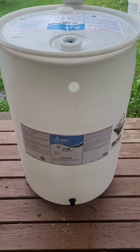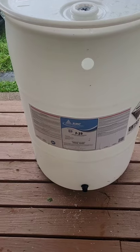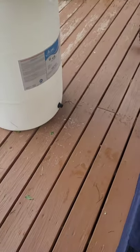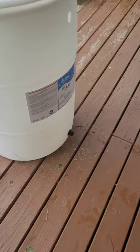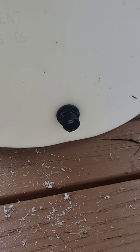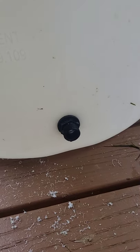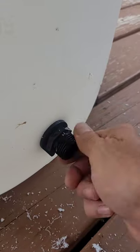I had already started the project before I decided to record this video, so I've selected my two rain barrels here. Using the provided saw tool, which I've attached, I have started drilling my holes. Down three inches from the bottom, we used a one and one quarter inch bit to drill a hole. Up here we have the hole drilled. Now let's go ahead and insert the gasket.